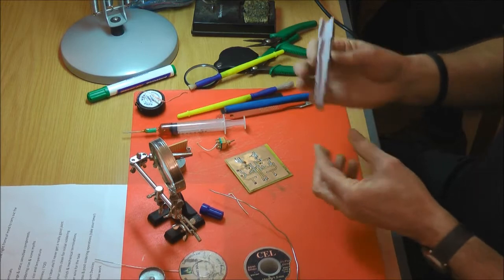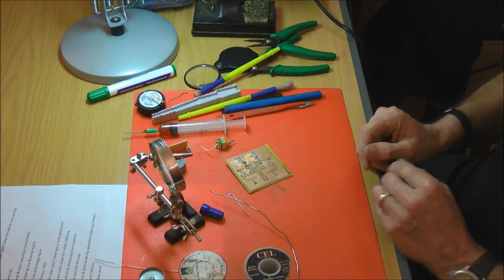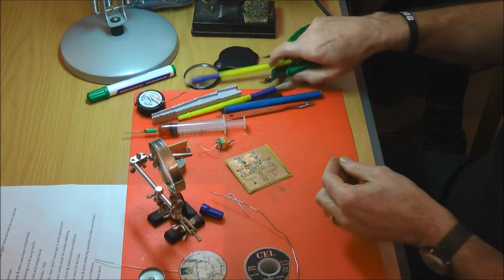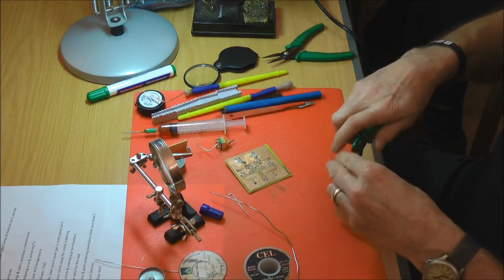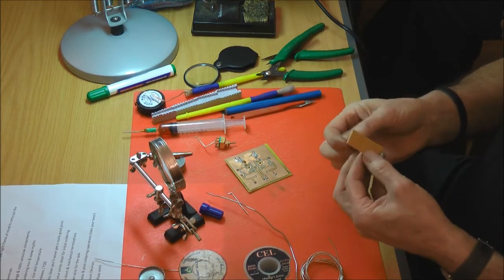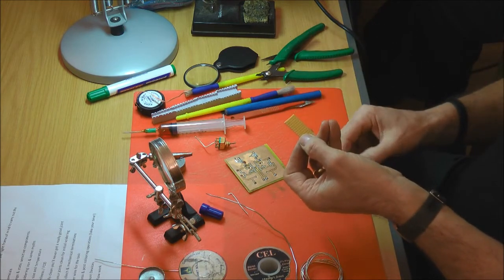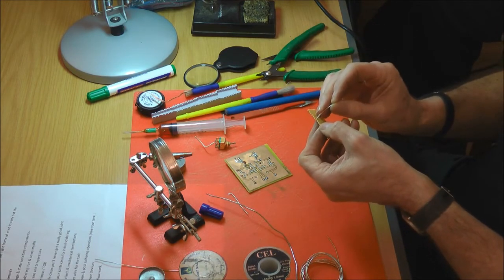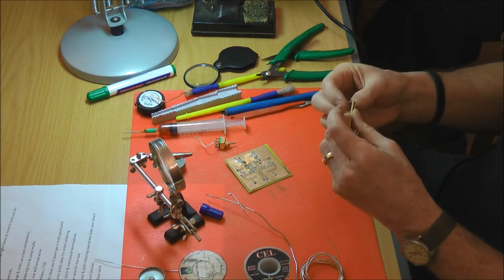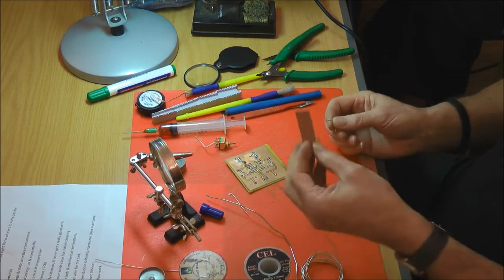Going back to preform tools, that was about £6. I was talking to a mate about the paste tool, which is £48. He uses a much simpler tool, which I use subsequently. I was quite impressed. I thought, never thought of that. If you've got a piece of stripboard and you've trimmed it, you've got 0.1 spacing. So if you want 0.6 or whatever, you can stick your component in, bend it over the edge, and then form it to the correct pitch with an odd bit of stripboard.